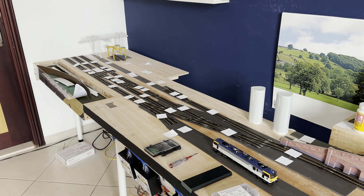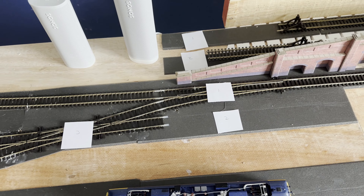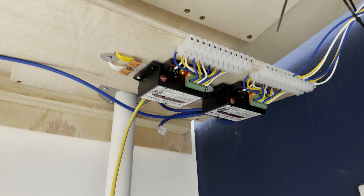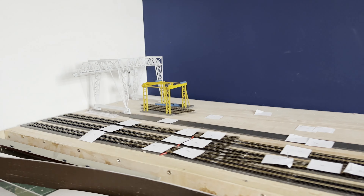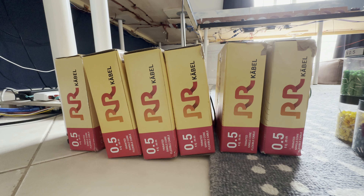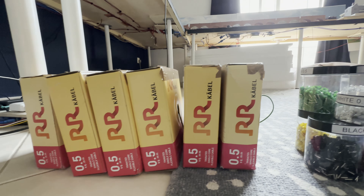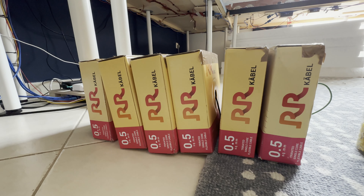Building on my dockyard video and updating the track — a lot of change here. All these little bits of paper show where I need power and point control, all to be wired up for block detection. That means I have another board now, under here, where I'm going to have two of my point systems. There'll be another two block detection modules on order because I need 16 blocks and eight points. I've also switched from 0.75mm wire to 0.5mm wire with matching ferrules, to make it easier to connect to those MP1s.